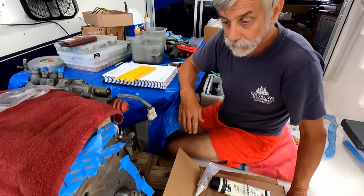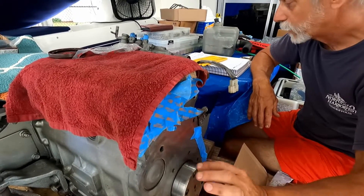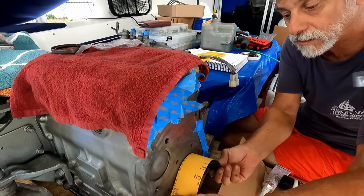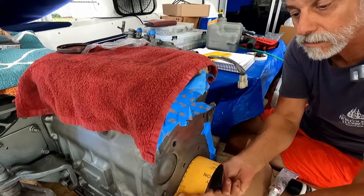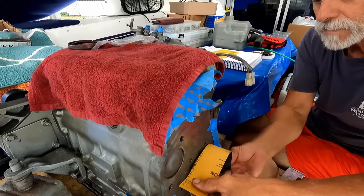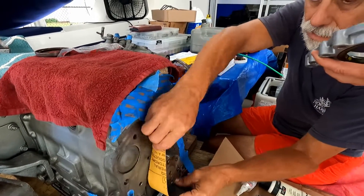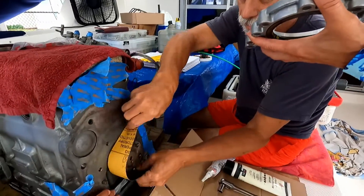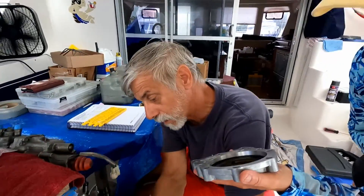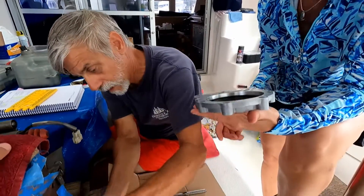This surface is a little dirty, Steve. You can run your finger on it and feel it's rough, so we're going to use 800 or 1000 grit sandpaper to clean it. You don't use your fingers directly because you could cause indentation. After Steve cleaned that area with sandpaper, we also clean it with mineral spirit. The bracket surface is now clean and ready.